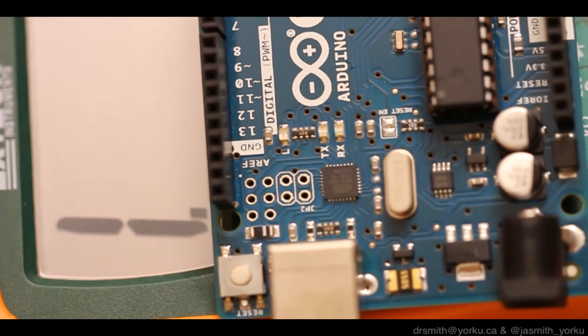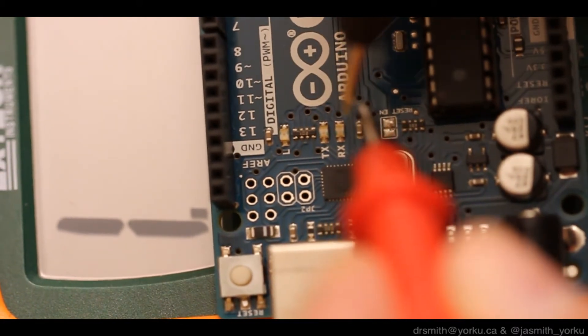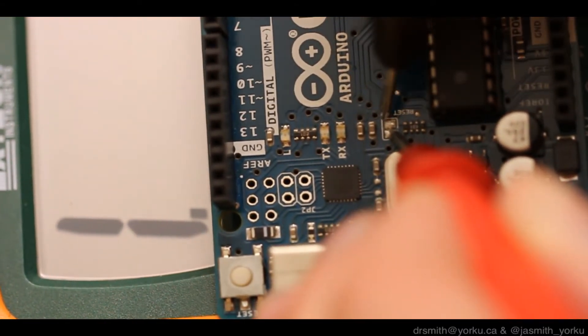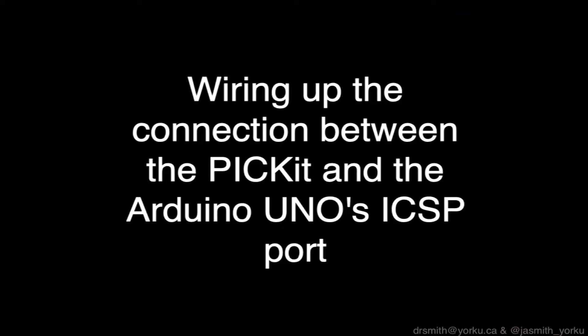Now I'm going to test again with the multimeter. I'll take the two probes and tap them into the pads. I'll test it first without touching the pads, and then on the pads — contact and disconnect and contact again — just to make sure I've got a good connection. It turns out it's been cut properly.